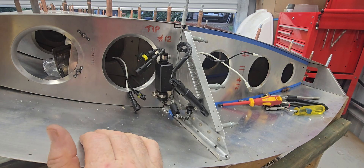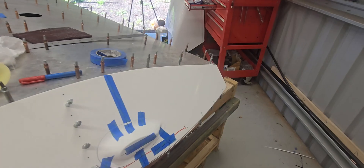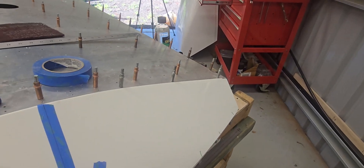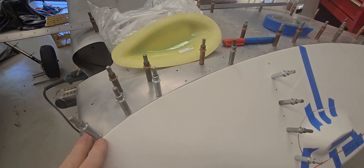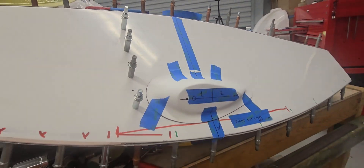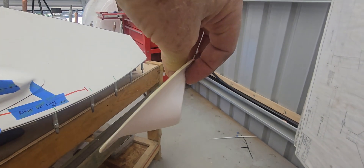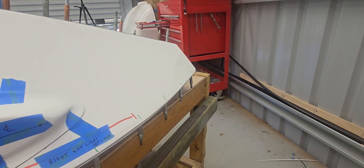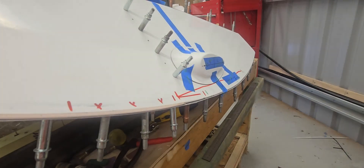Just to reiterate, the tip will be removable. I might go ahead and dry fit that tip now. Good morning and welcome back — I'm just halfway through the set-out for this wingtip, just dry fitted it on the right-hand side. I've also set out the nav light build-out piece — I'm not sure what you'd call it, but it's supplied by Aero Engineering, it's part of the Aero Burst nav light. It gives you a nice right angle, perpendicular to the spar.